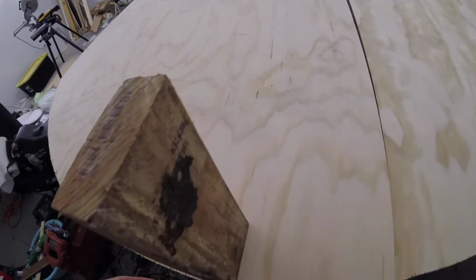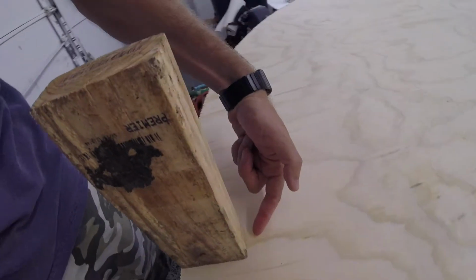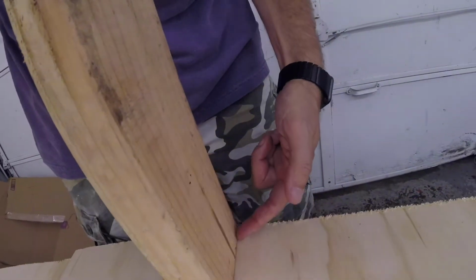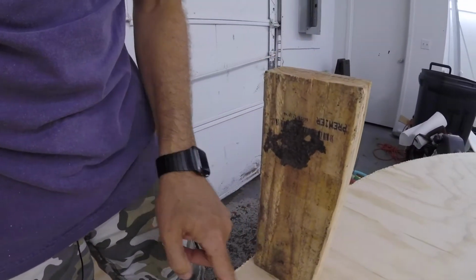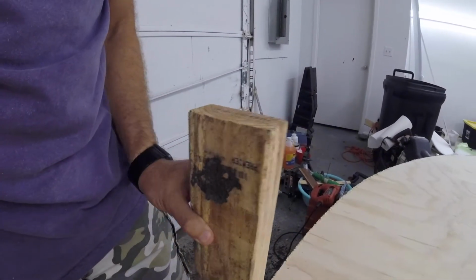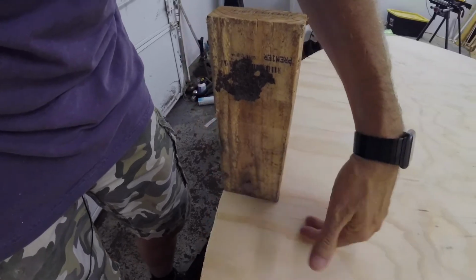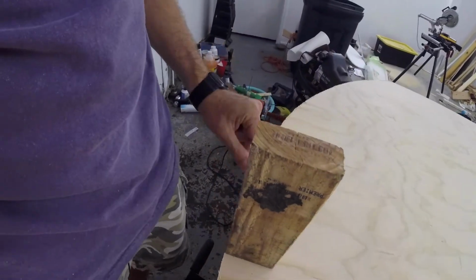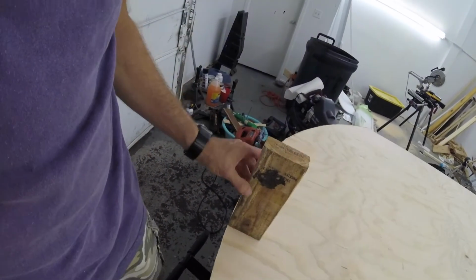And when I put one right there, what I mean is we're gonna cut out this shape. Trace it, and we're gonna cut it out. There's gonna be a cutout right here, and the roofing beam is just gonna slot in there. And then we're gonna use some hurricane ties to connect it properly to here. There's gonna be something connecting it on the front. It's all gonna be safe and secure.